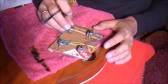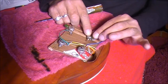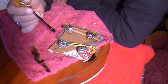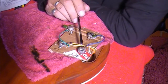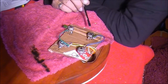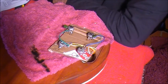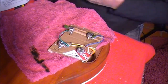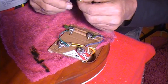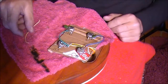So we've got our capacitors set up on our tone knobs - they can just be pushed down out of the way while we work on the rest of the wiring. Now what we need to do is set up some earth wires. We need an earth wire running from both the volume pots - so the neck volume to the bridge volume. And we need the same on the tone pots as well, an earth wire running from the bridge to the neck tone pots. So we need two short wires - I've got a grey one and a yellow one left over from the kit - just trim those ends, tin them, and connect up those pots.